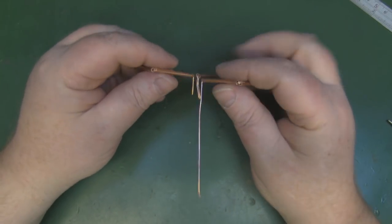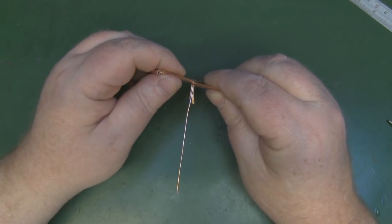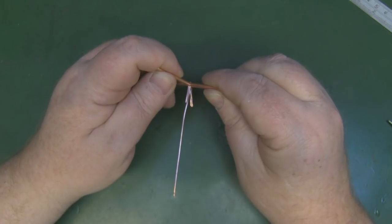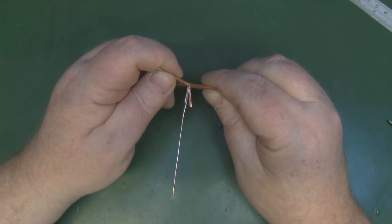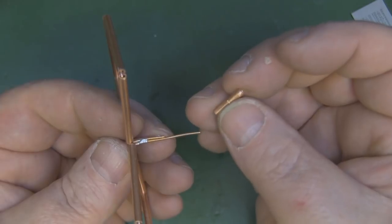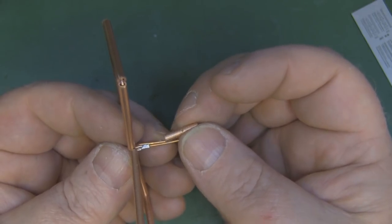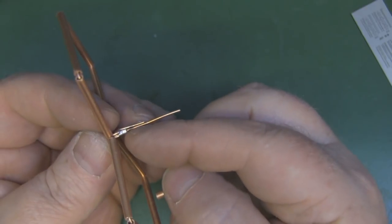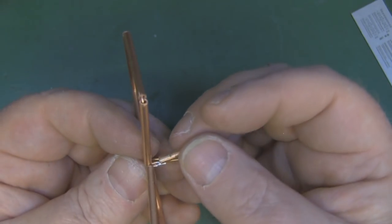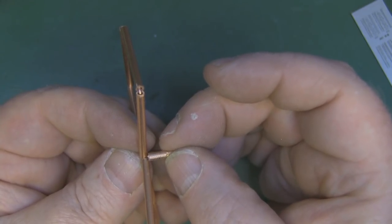All tubes are now fed onto the copper wire. I'm bringing the two ends together and adding a little solder, making sure that leg is about 20 millimeters long to give plenty of room to work with. For the final detail on the elements, I've measured a length of leftover copper tube at 14 millimeters. I'll use it like a solder cup — pre-tinning it and soldering it onto the element leg. That will give us a good connection to the reflector and SMA connector.